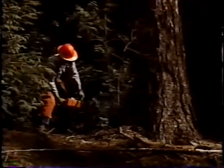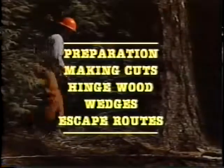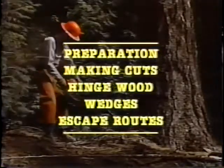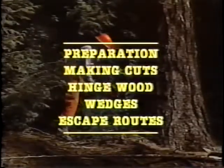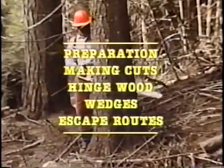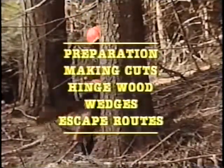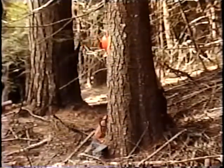This presentation will cover five main points. We'll look first at preparing yourself and the area around a tree before you fall it. Next, we'll look at cutting technique: what makes a good undercut, how to make the cuts of the face properly, and what happens if you don't. The third part will examine the importance of hinge wood, often called holding wood, in safe falling practice. After a word on wedges, we'll close with pointers on staying safe while the tree is on the way to the ground. Let's get ready to knock a few down.